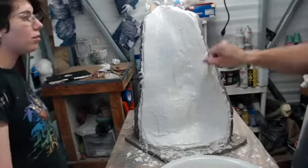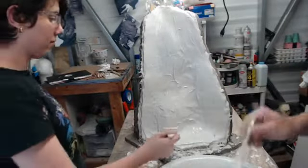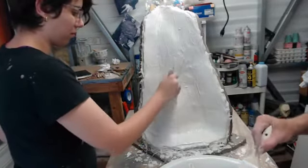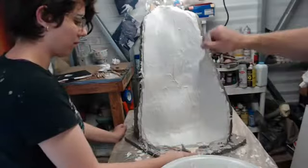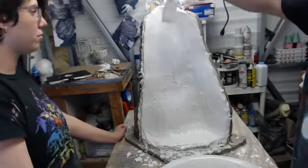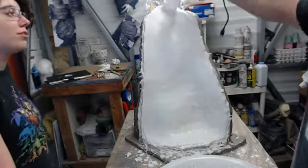You're making little scrub brushes? Yeah. Like another question popped up. What? Oh, on there. I'm not using Ultracal because it's a little more dense than Hydrocal, and we need it to be quite hydrophilic to suck the moisture out of the latex for the dwelling process. You can use Ultracal, but it's so dense that sometimes that dwelling process can take longer. So that's the only reason. Okay, we need a little scrub brushes for this, for the eventual smoothing of this.